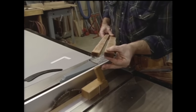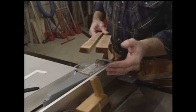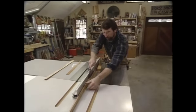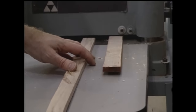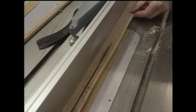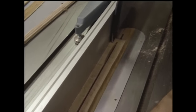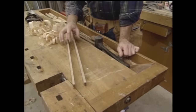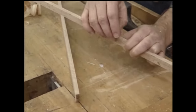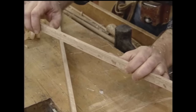Now I want to make the pieces uniform in thickness. I could run it through the surface planer, but that would take several passes, so I'm going to start by making a pass through the table saw. I've set up this block which acts like a feather board to hold the piece tightly against the fence while it goes through the saw — I'm going to rip it about a sixteenth of an inch oversize. Then one pass through the surface planer will give me the thickness that I want. Now it's back to the workbench to joint an edge, and with that good edge against the rip fence, we'll get the ultimate width. Keeping the grain parallel pretty much assures me that when I bend it, it won't split.